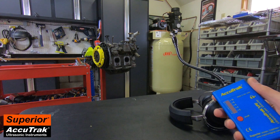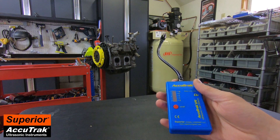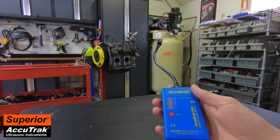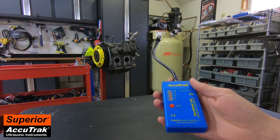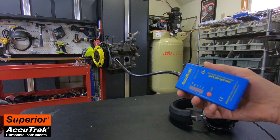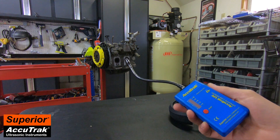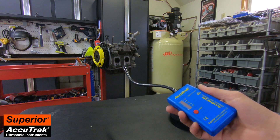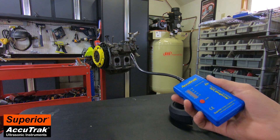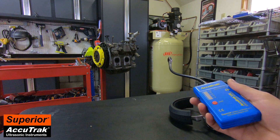What's so great about this technology is that it works with any gas — it could be refrigerant, could be nitrogen, could be compressed air, could even be a vacuum. All of those make the exact same noise that these instruments pick up. You may have seen our VPE or VPEGN in a few videos relating to the HVAC industry; that's where it's probably most prevalent, finding refrigerant leaks. But of course these instruments have so many applications.